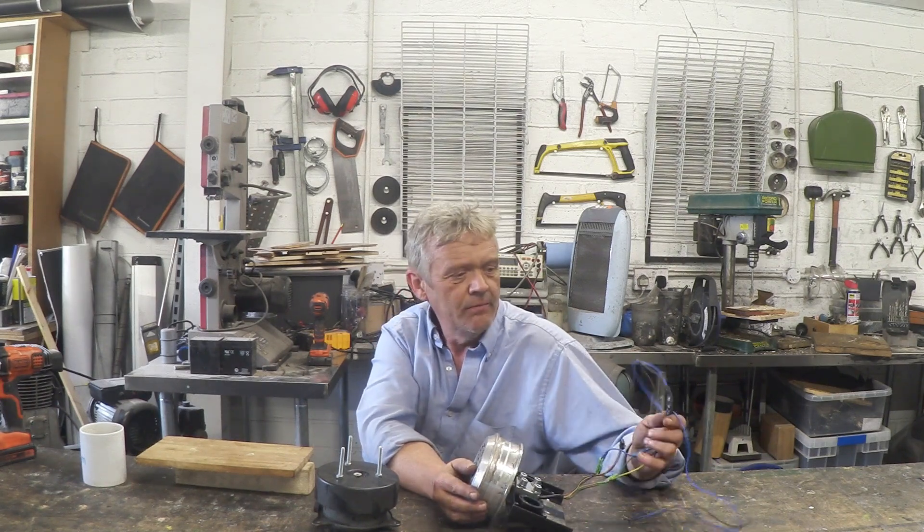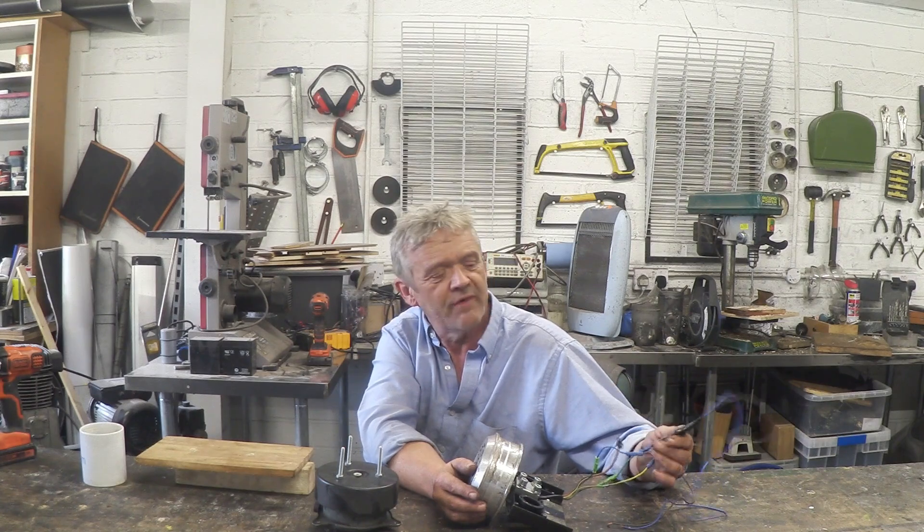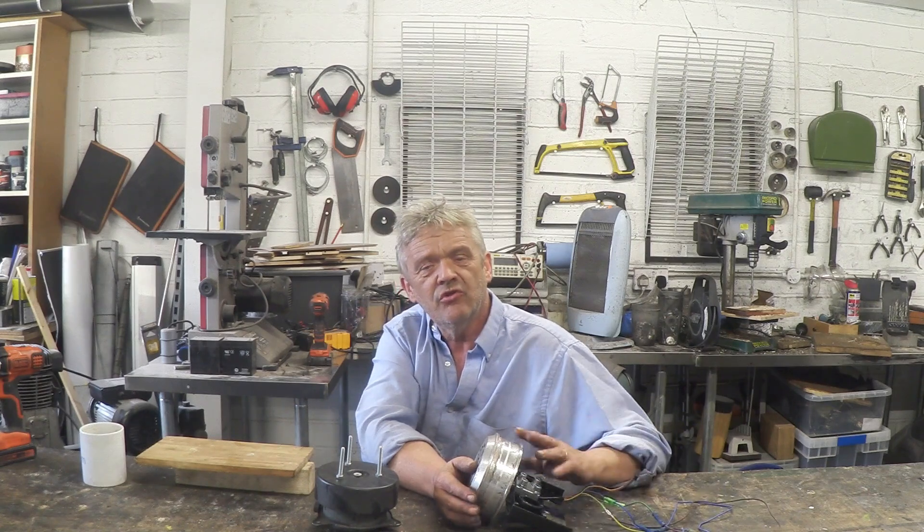The three factors are: number of turns, strength of the magnetic field, and the speed at which it turns. This hoverboard motor has neodymium magnets so the magnetic field is much stronger, making it a little better. But the losses from poor blade design and the silicon three-phase rectifier made from 1N4007s are, to my mind, insignificant compared to the effect that speed has.